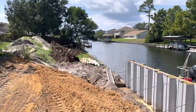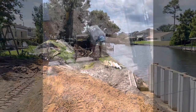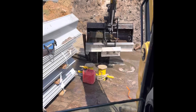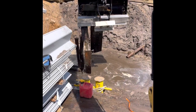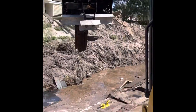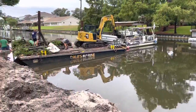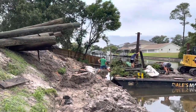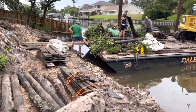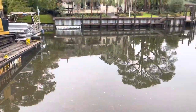Now it's time to start cleaning up the site over here, excavating that wall, getting it removed, and continuing on down. We've got 250 foot of wall to be installed here. Reclaiming old seawall sections — I'm going to cut up the sections to pull them out. We've got this section of wall completely removed, stacked up on the barge, getting ready to haul it off. Then we'll get started on these pilings up here, put a pile wrap on them and get them installed. I think I've cleaned it out pretty good — didn't leave any debris down there, but we shall find out as soon as we start setting pilings.